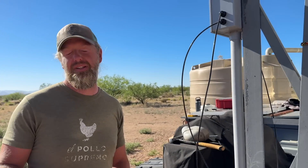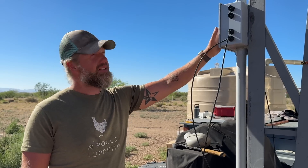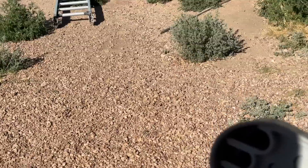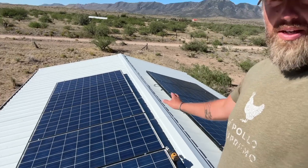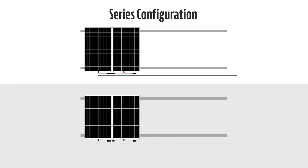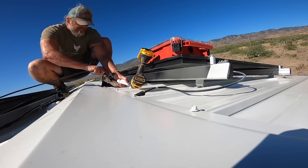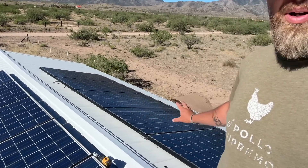Good morning, we're back out. Last night we did a little bit of work on the wiring — we didn't record it all, it was really hot and late in the day. What we're doing here is installing a junction box. We have our 8-gauge wire running out, pulled all the way down to the solar panel where we have those extra spots open on the combiner box. We'll make up those connections later, but now we need to go back up on the roof and focus on getting all the PV and ground wires pulled down into the top of this box. We've connected these panels in series — you take the positive of the first one to the negative of the next one all the way down the line. That means the negative at the beginning still needs to come all the way back down to the combiner box. We have four wires to make up: positive and negative for each array — that's 45-foot runs — pulled through waterproof enclosures in the ceiling.